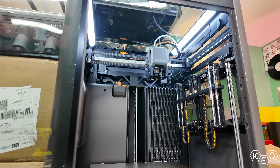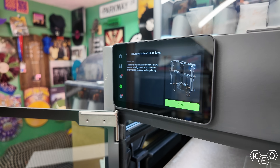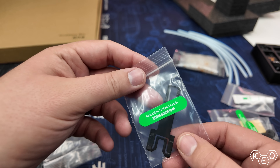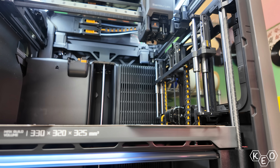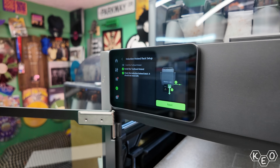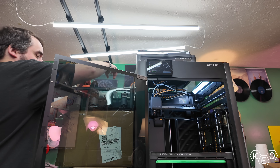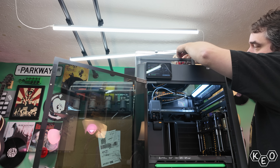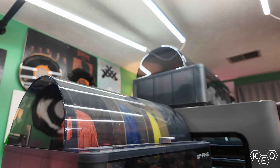The one thing that's different about this machine setup is related to the nozzle rack. There's a whole setup that begins with you installing the hotend latch, which is the thing that ultimately locks the nozzle being used into the tool head. This piece gets removed by the nozzle rack during nozzle changes automatically. From there, the thing prompts you to load filament and bind colors — it automatically detects which filament is in which AMS and tells the printer which one goes with which nozzle.